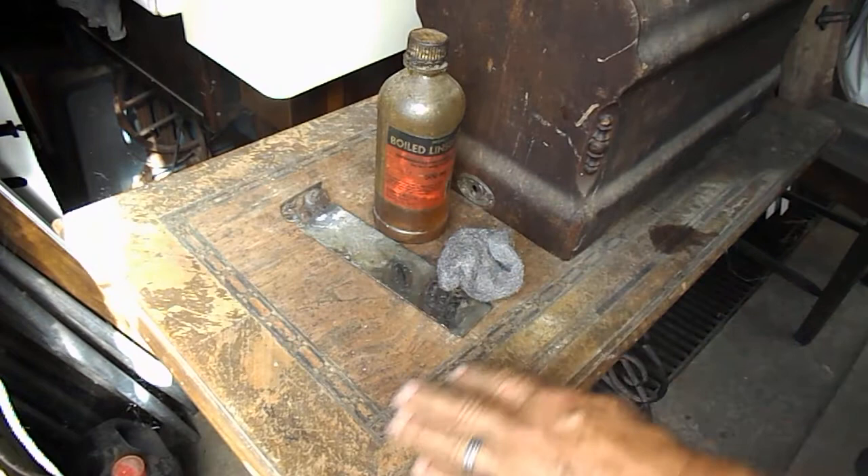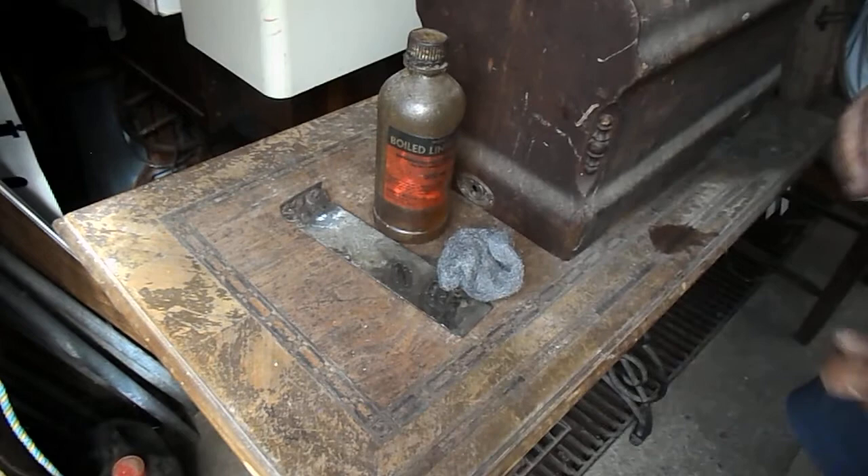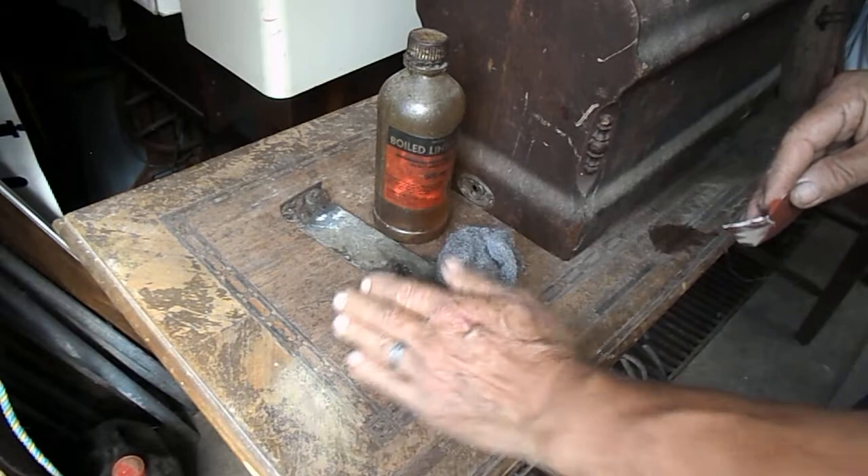You can see here all this dark brown — that's all shellac. We only do this with original sewing machine cabinets that actually have the shellac on them. How we can tell it's shellac is you get down there and sand it just lightly — it comes up as a grain, and there's all your powder. That's what shellac does: it just goes back to crystal.